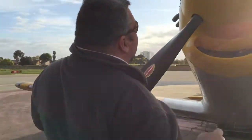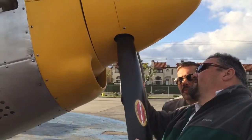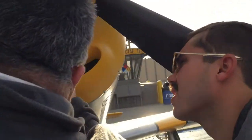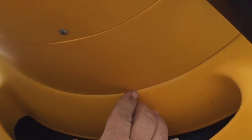You see the screwdriver slot here? From that side to that side - you want to see that dimension of play in the gearbox. I'll put my fingernail there and move it - see that slop? That slop is about the width of that screwdriver slot. You want to see that much movement. If it gets more than that, something's going on. If it's less than that, the gearbox usually runs hot - that's a manufacturer's thing. This is about right.